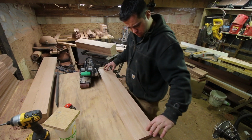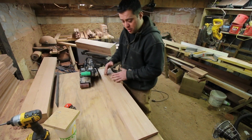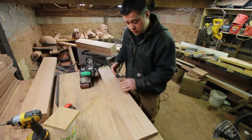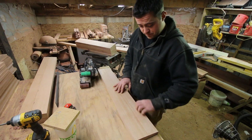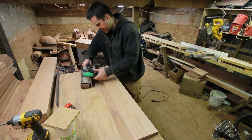What is that called? Parallel? So once I've run on that diagonal, I want to run in a parallel to make sure that all those sand marks that get left in it on that diagonal get removed. But I want to be extremely careful, and that's when I would lower the speed so that I don't cause scratches in the wood. There's going to be a jump cut there because I messed up.